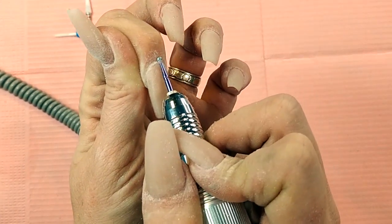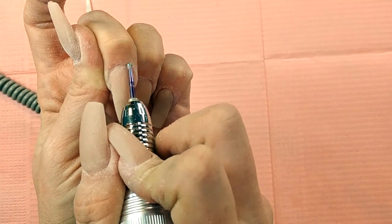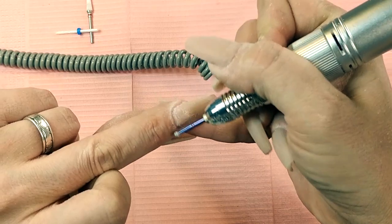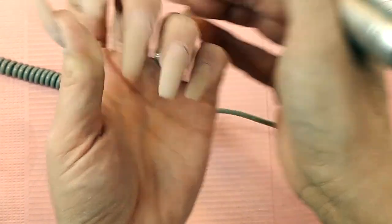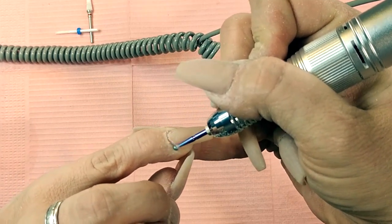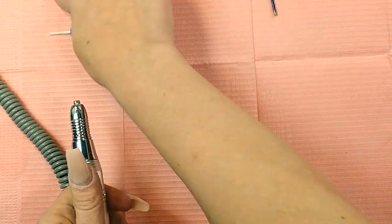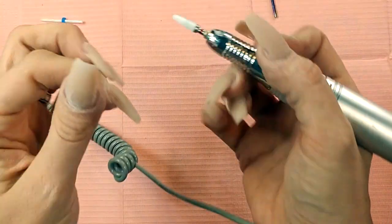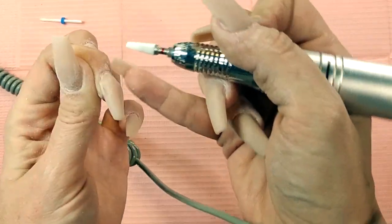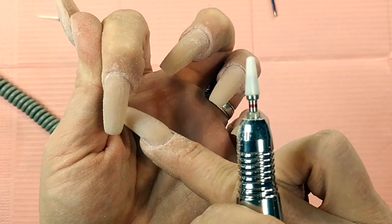Basically, all you're doing is flushing it out. You can use a smaller bit. Just make sure you're touching the entire surface all the way around. It will create somewhat of a ridge right there, so you want to either buff that ridge out or use a different bit to smooth it. I'm going to run it along the back and smooth out that little corner or ridge — this is a safety bit so I can do that — giving me a nice flush surface.